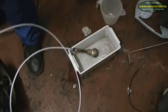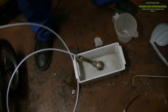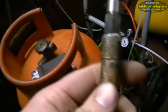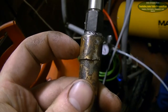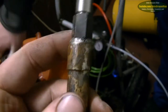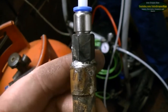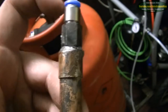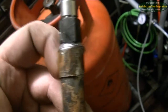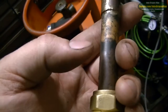It's the first time we've had that nozzle out of the packaging — we inspected it when we first got it, but I just literally chucked it together. It's the first time it's had compressed air going through it. I literally just got all that and soldered it together. That's a brake pipe union on the back plate of the end cap on a copper pipe, screwed into the brake pipe union — it's one eighth British standard pipe thread. Literally all I did was solder it all together, got it really hot, then drilled through the whole thing.